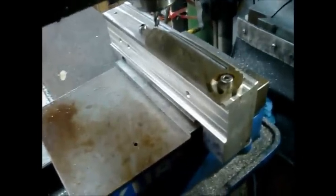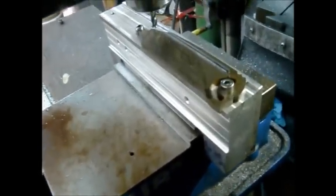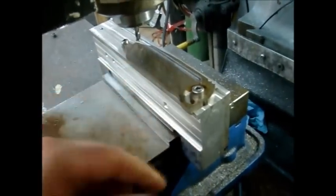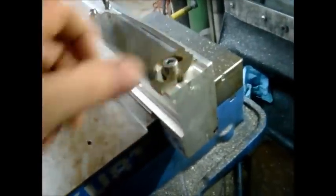So bear with me, I'm going to do a little bit of rambling here. Something I'm picking up, seeing as how I do this full time and I've got to put food on the table — like they say in the industry, time is money. Especially in knife making when you spend 10-12 hours making a folder, it's really helpful when you find ways to save time. This is probably a dull moment for any kind of machinist, but I built this jig plate that saves me a lot of time indicating where the blades go. I just bolt them down and they're good to go — gives me good, reasonable tolerance within a couple thousandths, and that's really all you need for a lot of this stuff.